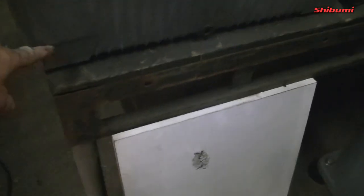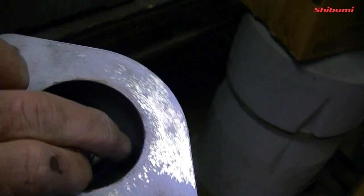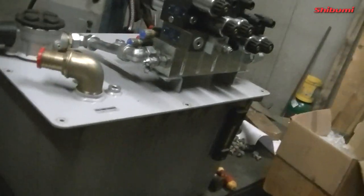So the tank has just underneath here four 10mm threaded inserts coming up into the tank. Because these are also threaded, I'm going to drill them out so that the nut can go up with a washer and get bolted from the inside with a big stainless washer on the inside and a locking washer as well, and mount them up and then mount this down onto the angle so they'll go this way.